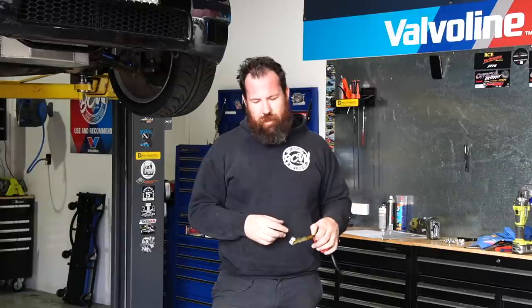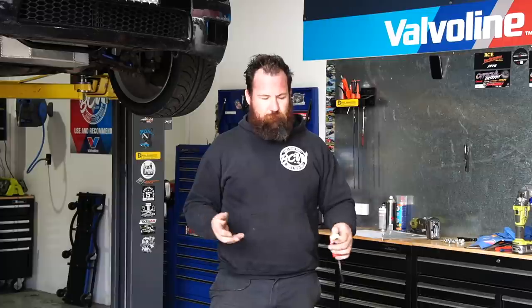So definitely keep in mind when you're welding stuff, make sure you clean all the paint or whatever's on it: rust and mill scale, powder coat, plastic, who knows what's going to be on it. Make sure you've got clean bright metal when you are welding.